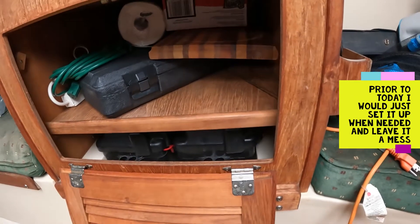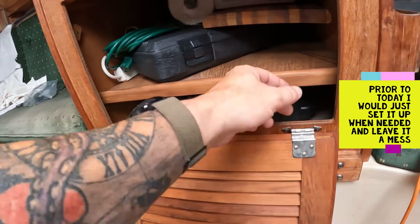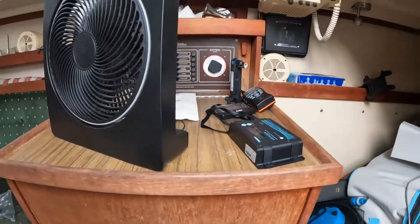There's going to be one hole going in, and I'm going to be adding quick connects to the actual install so I can just leave it and not have to worry when I'm plugged into shore power. That's why, to this date, I haven't fully installed it because I'm always on shore power. And now we're going to start cruising a bit more, and I just don't want it laying around being all sloppy. Basically, I'm going to be doing one hole in the side, bring my wires down. Both of these batteries are in series right now, so I'm going to go one negative, one positive.